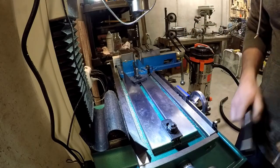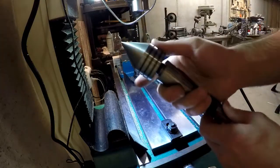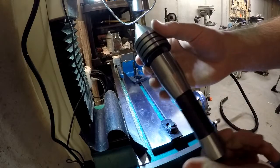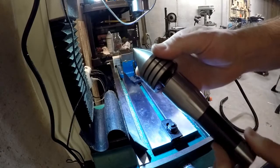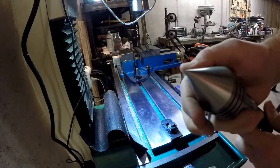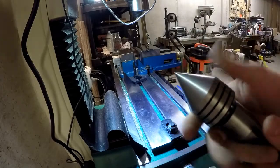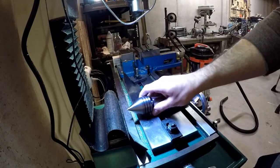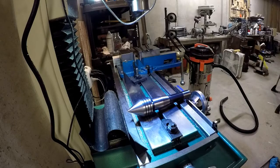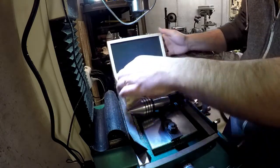So there's a bunch of different ways to do this. What I have here is called a live center — this is just generally used on a lathe. But what I use it for is the quick and accurate enough way to get it centered. What you could use, and what is probably the more accurate way, is called a coaxial gauge.